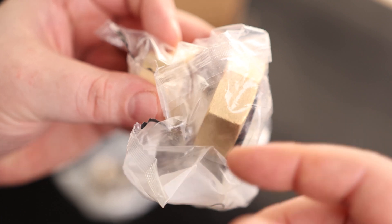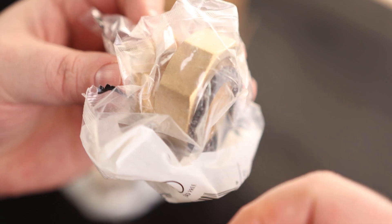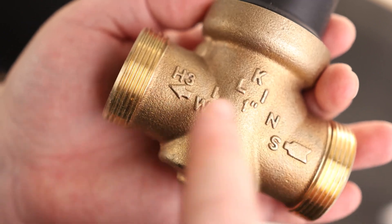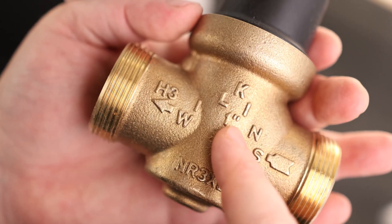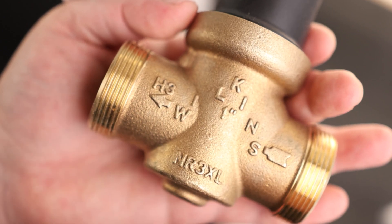But if you're not going to be taking all the plumbing apart and you're going to do it the easy way like I'm going to be doing it, then all you really need is this seal — but you do need both fittings to get these seals. This PRV is an NR3XL. I'm currently using an NR3, so I'm just kind of praying it's going to fit properly. This is a 1-inch, so that's for 1-inch pipe. Yours might be 3/4 inch, 1-1/4, or 1-1/2 — those are the most common sizes.